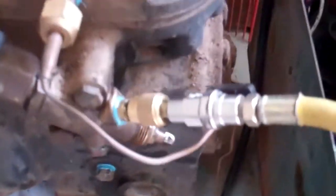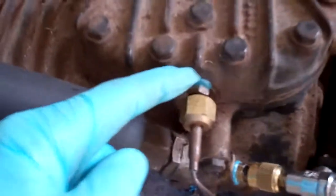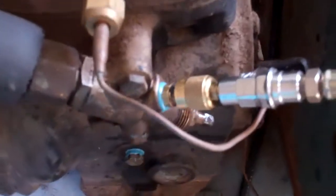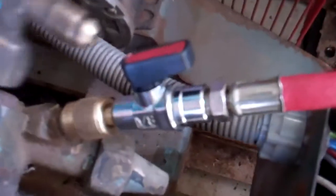We've had a bit of a tidy up. Put the low pressure connection onto the cylinder head, which is where it should be. There's a blanking plug just for that purpose - so why put it on that valve? I don't know. They've done the same on that side with that T. I'm going to put that in the head connection, just where it should be.